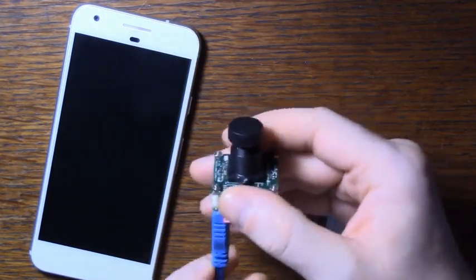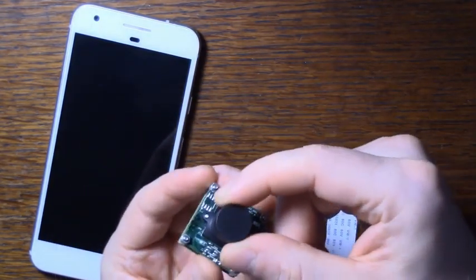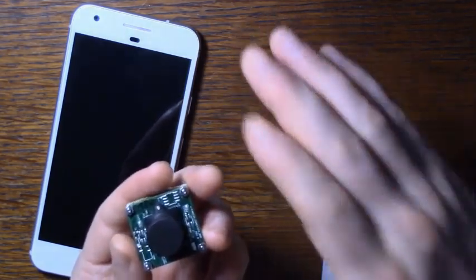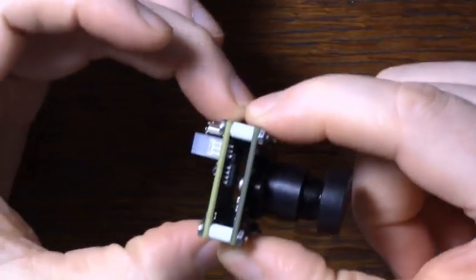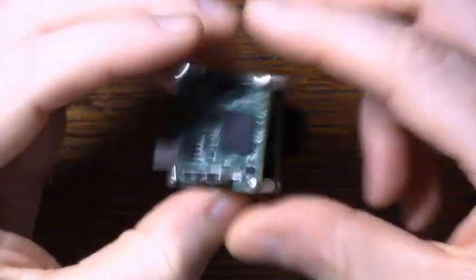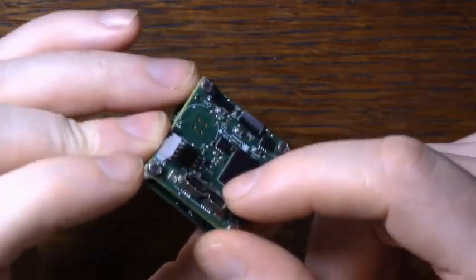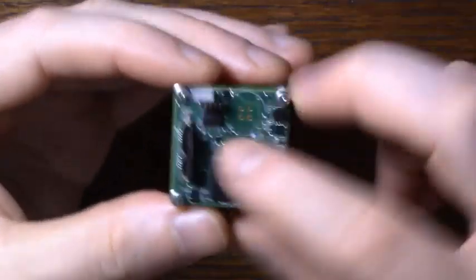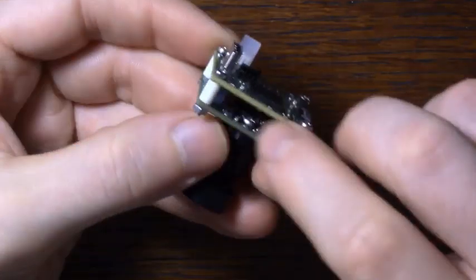It also works on USB 2, but obviously with reduced frame rates. Still, it's pretty fast for streaming. This is their fixed focus model, because it annoys me when cameras are constantly trying to refocus. But they do also sell automatic models as well, I just haven't tested any of those. It comes as two boards that just kind of snap together, and then can be fastened with some screws. I think this is so that they can change the plug type, because they sell these with USB-B type connectors, and they also sell USB-C type connectors. But these top boards might also add other features that I'm just not even factoring in here. So it is a pretty cool design that they're able to exchange it, and it probably helps with thermal regulation too, to not have all the stuff squished together like that.